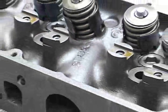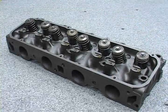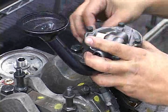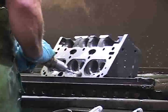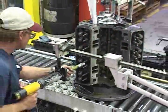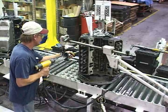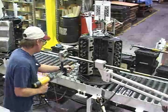Mercury Remanufacturing settles for nothing less than new parts that are specially designed for marine applications, such as heavy-duty valve springs and high-volume oil pumps. Subassemblies such as cylinder heads and intake units are cleaned again, pre-assembled with new marine parts and tested so they're ready to bolt right on. This is where many engine rebuilders end the process and ship their engines out, not at Mercury Remanufacturing.